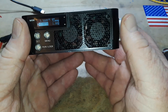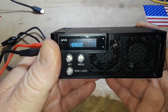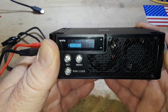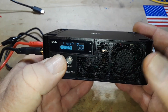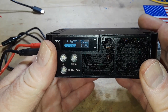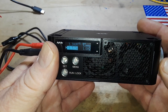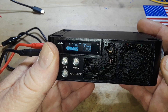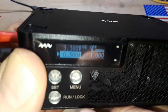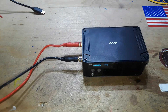We can set voltage, resistance, power. Right now it's on about 1.1 amps. I can turn it down — we can set it down to say 500 milliamps. If I hold this button it goes much faster. So there, we turn it down to just about half an amp. You can see that little 'CC' up there — that's telling us we're in constant current mode. Let's hook this up to my power supply.